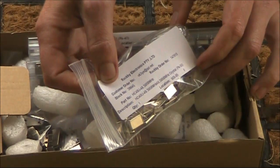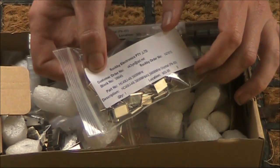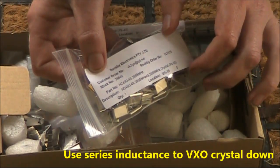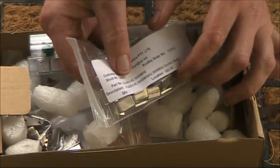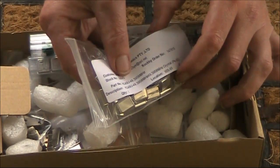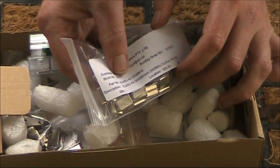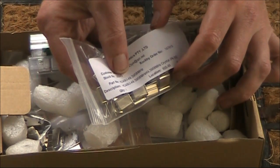Burrowing down a bit deeper, we have some other crystals: 49.395 MHz. Multiply that by 3 and you get just above 148 MHz, so a bit outside the 2m band. But if you were to use them on their fundamental, multiply it by 3 and then 3 again, you might just get below 148 MHz as the resultant output. Or, if you had a 1 MHz IF, you could use it as an oscillator in a superhet receiver tuning parts of the 2m band. A 1 MHz IF is very easy — almost everyone's got one in the form of an AM broadcast receiver. Even easier if you're in a country where AM radio has almost disappeared. As the tunable IF on AM, you could be slope detecting FM signals in the 2m band.